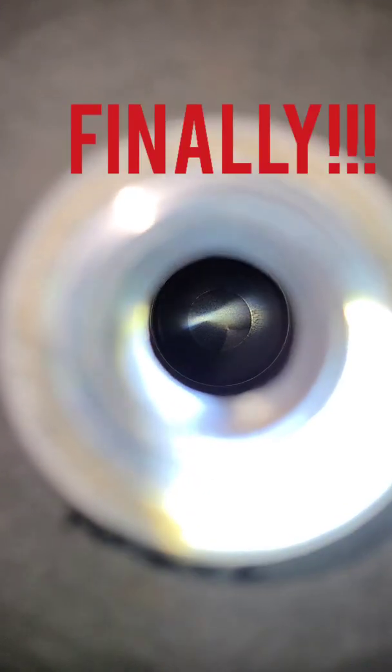There we go. That's a great shot of the inside. See how it's kind of shiny like the inside of a Coke can? You might have a little bit of white residue on the inside called aluminum oxide. That's fine, as long as you don't see any bits and pieces floating around in there, and I'll invert this before, as a part of my inspection, I try and clean it all out. All right, that's the inside of a scuba tank.